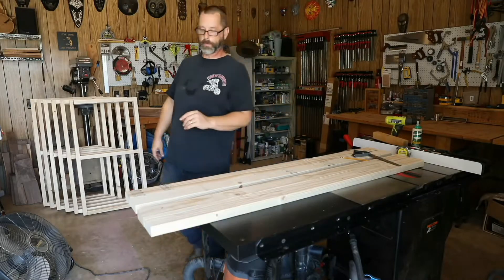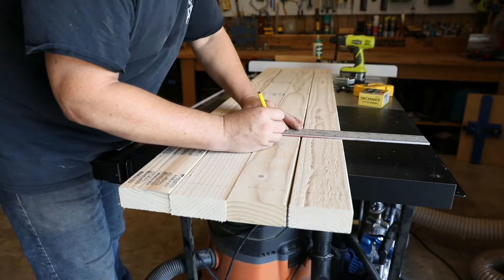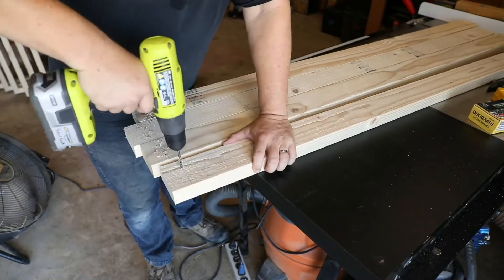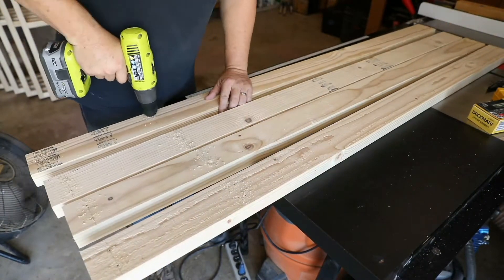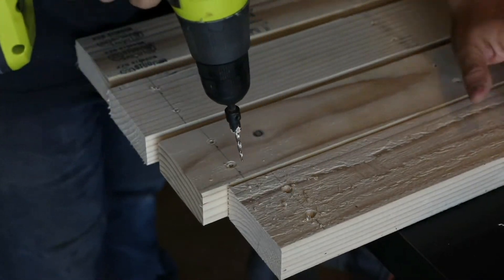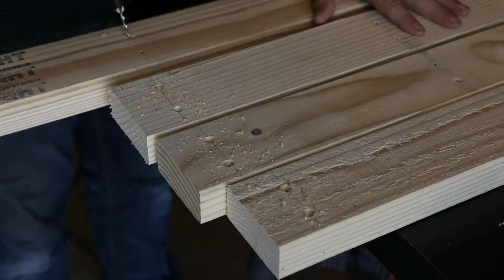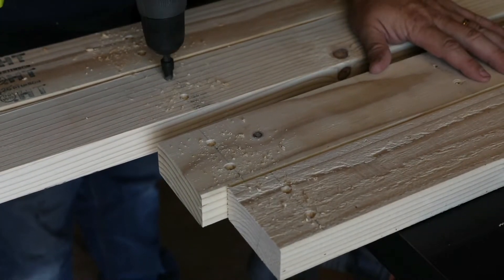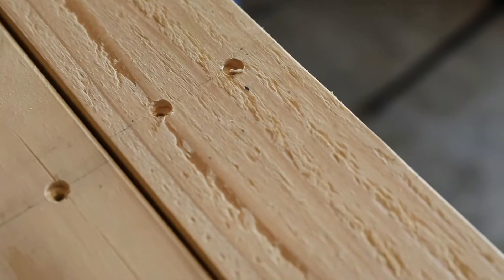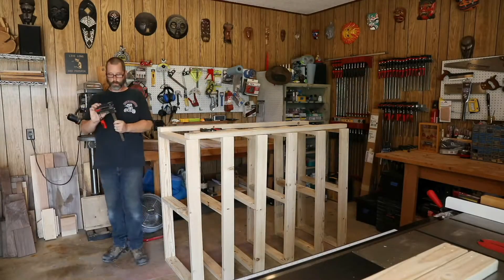We've got our lines marked and we're ready to go to the next step. Now that the lines are on the boards, I marked about three quarters of an inch from the edge of each board to mark where we're going to drill our pilot holes. I used a screw bit just about the width of the screws themselves and drilled pilot holes across the whole of the boards. Then I used a countersink bit. The countersink bit isn't really required, but from an aesthetic standpoint it makes things look a whole lot better. I'll put links to a lot of this stuff in the description — typically get this stuff at Amazon or Home Depot. The countersink bit is something you end up using a whole lot more than you think you would. Now it's time for assembly.